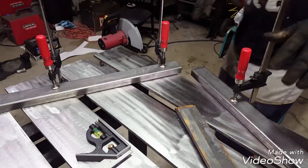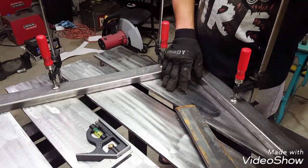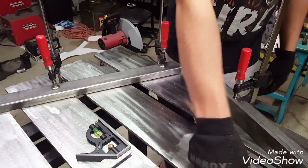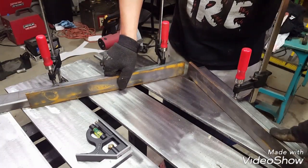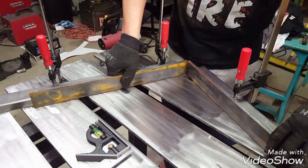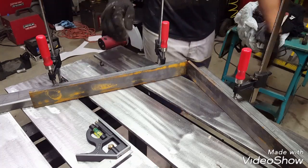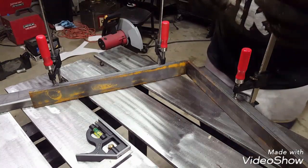Where a 90 degree fixture like this really shines is with little frames. When you have to build frames, say it's a piece of angle iron or flat stock — I slide them into place right where the corners meet. If you want a corner-to-corner joint, you just come out here with your MIG, zap zap, and it's all tacked up. Make sure it still lines up, move it aside, do the others, and then you can put them all together.